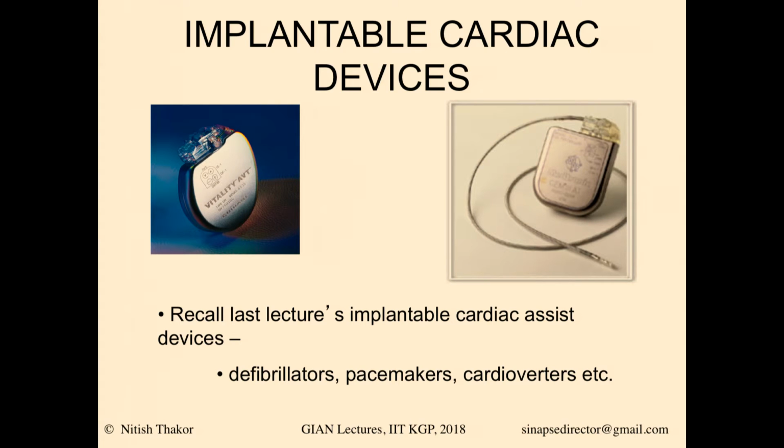So to make that can, it's very expensive, very difficult. So people have tried to do packaging in a variety of polymers. I mean, plastic is a general word for polymers, and something like silicone is a polymer that can stay in the body, but it's too soft, and it is porous, which means water can get through. It cannot be hermetically sealed. So yes, it is biocompatible, but it's porous. So plastic doesn't work.